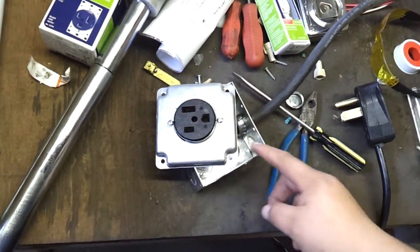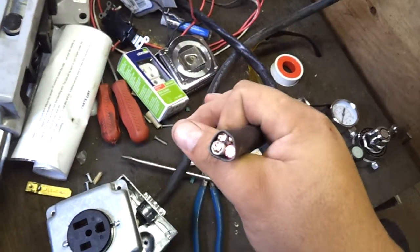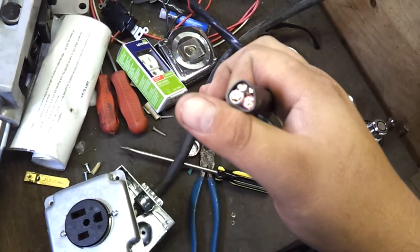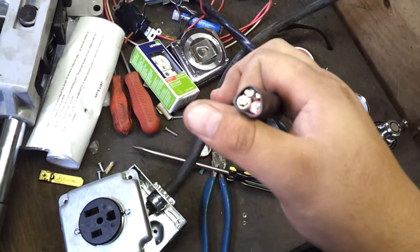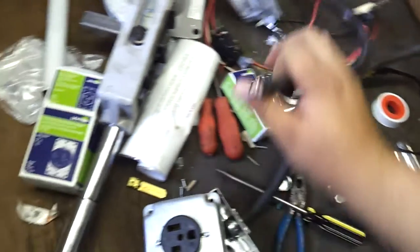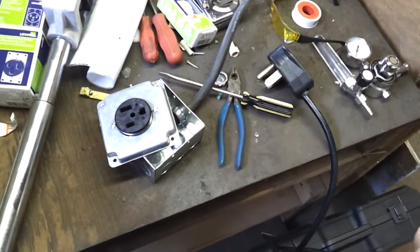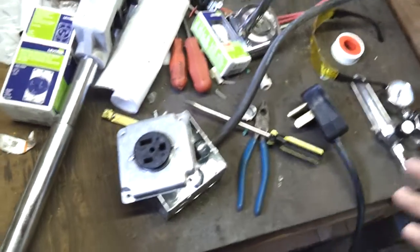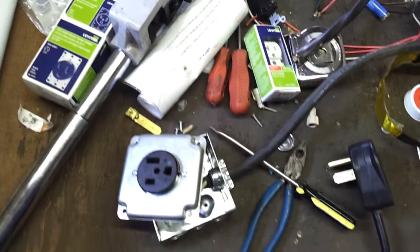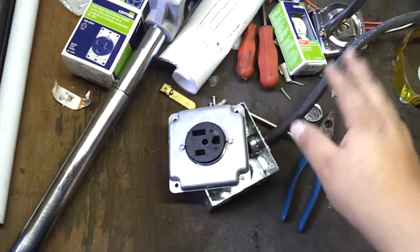This type of wire is heavily insulated. Here's a 6-gauge wire that I have for when I wire up the box to the wall — you'll see this insulation is very, very thin. It's just fine for when you're running wire through conduit, but if you're using it as an extension cord and it's getting beat and dragged around corners of benches and crap dropping on it, you need the heavily insulated wire — like the stuff you would expect from an extension cord. Buy that.